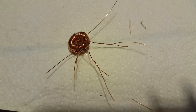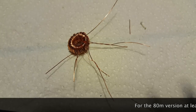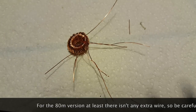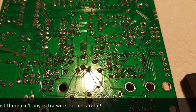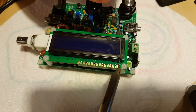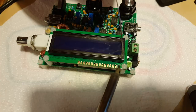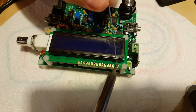The T1 transformer was pretty hard to wind — 68 turns for 80 meters — and it looks pretty ugly, but I guess you have no choice. Here you can see it on the board. I hope I wired it correctly; it doesn't look pretty, but what can you do? Now I'm soldering the LCD screen, and that will be the last step before turning it on.